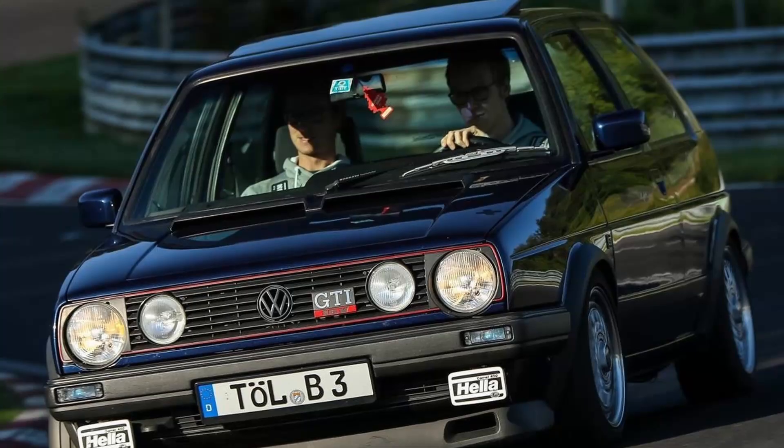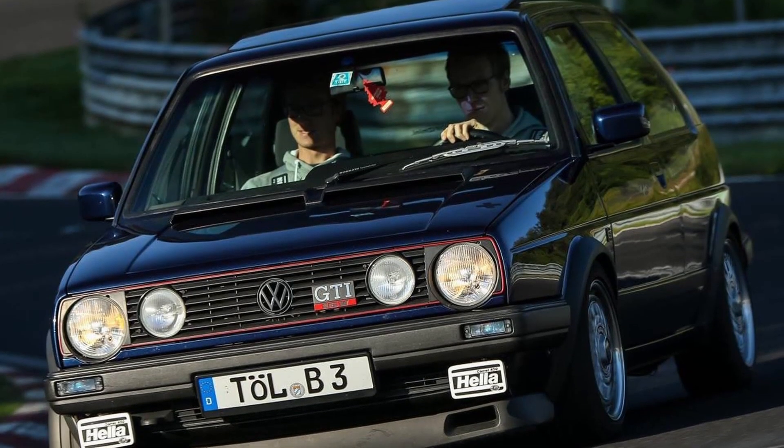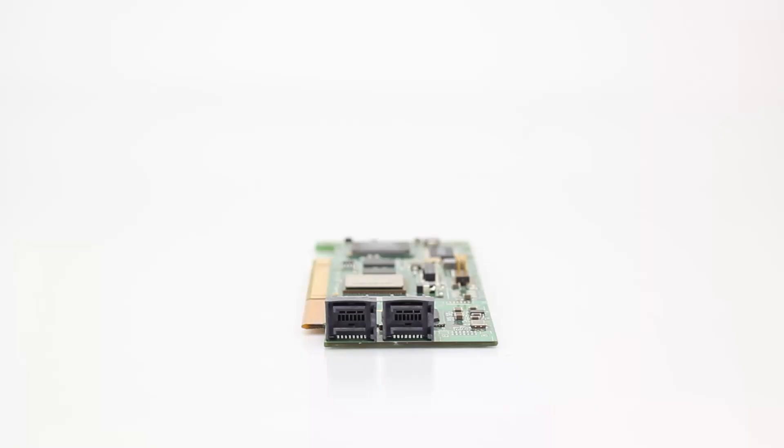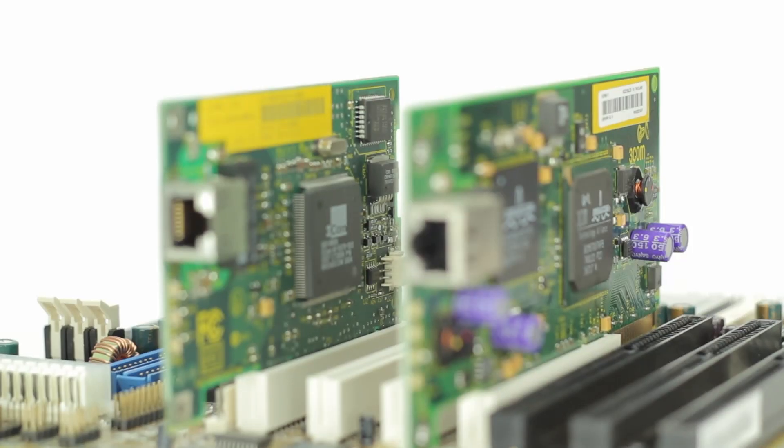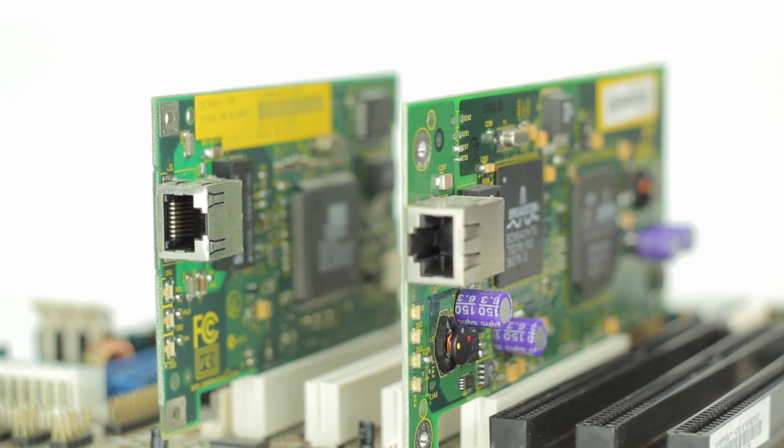As with my cars I love to keep old platforms alive and spice them up with some modern parts here and there. So avoiding any rational considerations my choice was pretty obvious, and when I realized that I can run pretty much any server grade 64-bit PCI or PCIX cards in the 32-bit slots there was no return and parts started to pile up. Among all the networking cards I acquired for testing there was one that actually had the RJ45 jack in the exact same position as the old 100 megabit card, so upgrading to that specific card was actually straightforward.